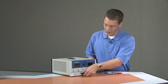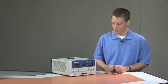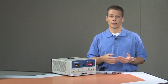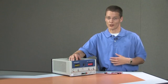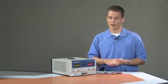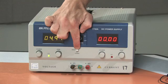The other feature of this power supply is current limit protection. I'll tie the voltage back to the building ground reference so I'm generating positive 5 volts. Often when testing equipment, we want to limit the amount of current delivered to that equipment. First, to protect ourselves — if something goes wrong with the circuitry under test, we don't want to generate too much power or push too much current through the system. At the same time, we want to protect the instrumentation under test, so if there's a fault we don't send too much current that could damage it.